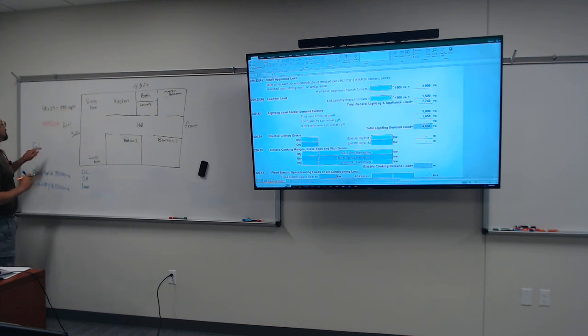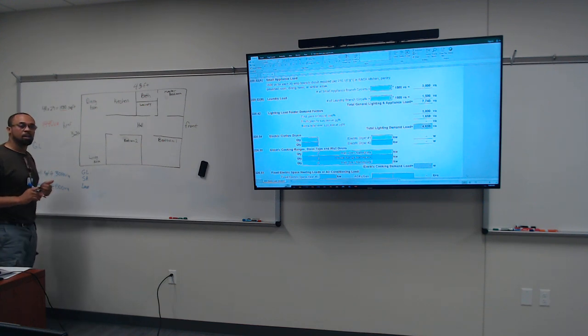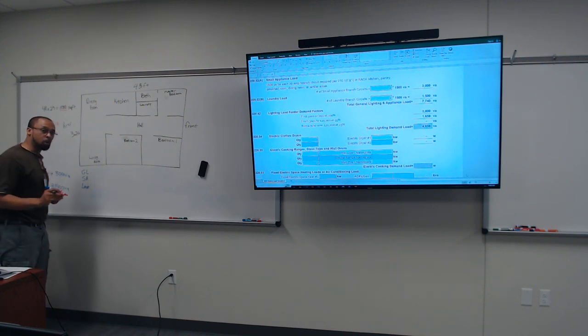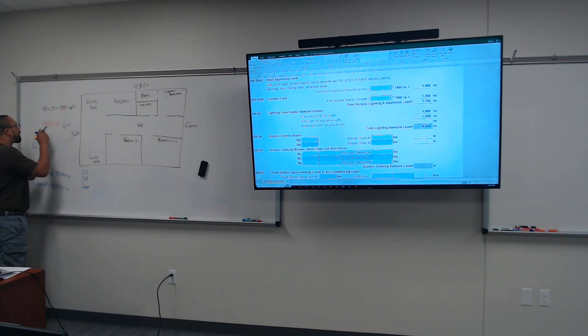VA. All right, so we have a total of 1,440 VA. All right, now, what are we gonna do now? What's the next thing we're gonna do? What are we gonna do to that 1440? Multiply it by what? Three VA, because Article 220.12, that tables, we're dealing with a home, multiply by 3 VA. All right, so times 3 VA, okay?